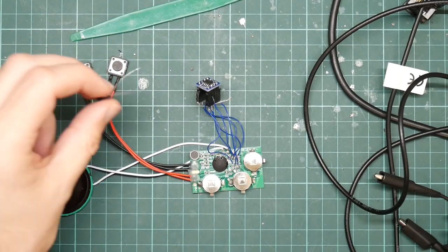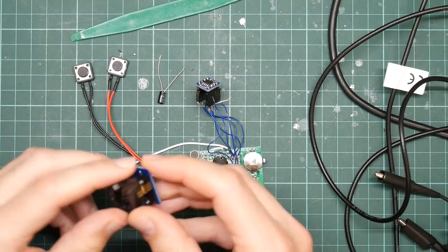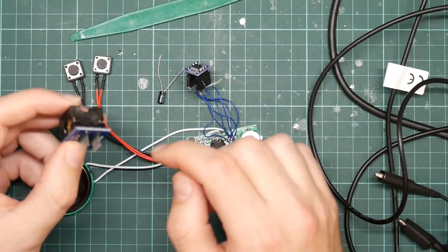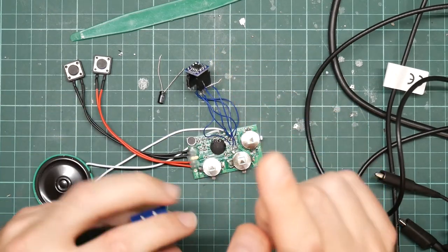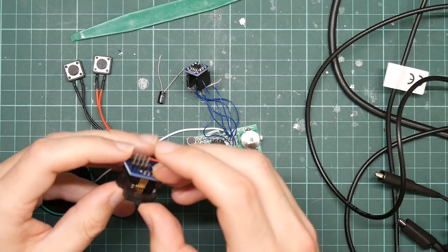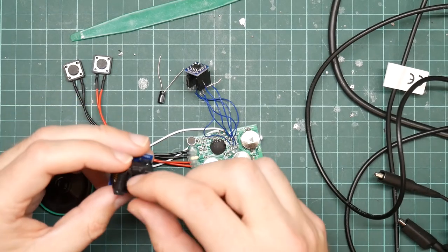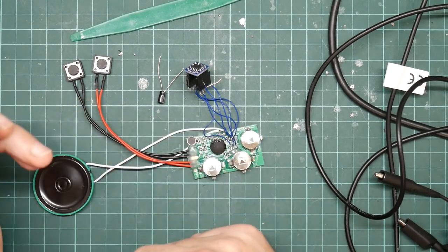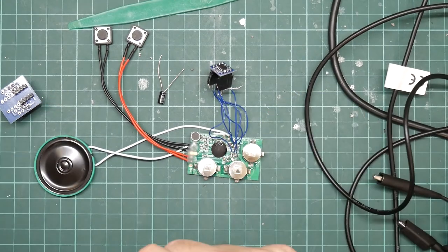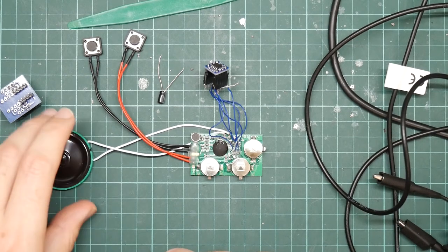Yeah, I took this off and it started working again. So clearly, the characteristics of this ZIF adapter are so different from this that this requires the decoupling capacitor, but this mustn't have one. That is weird. I am very clearly going to need to learn more about decoupling capacitors. Yeah, so that's all kind of strange. Anyway, that has been quite successful. I have done a number of nasty bodgers to this thing and it now still works. More or less. Well, as well as it ever did.